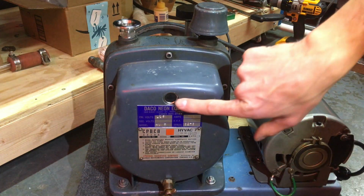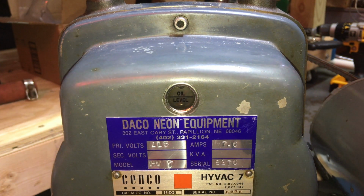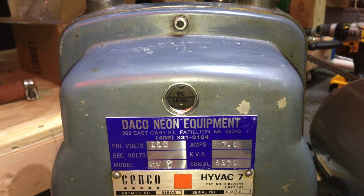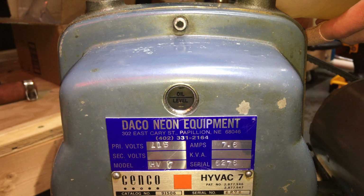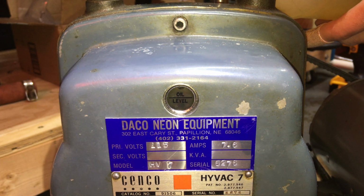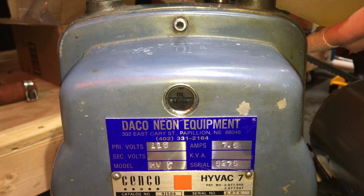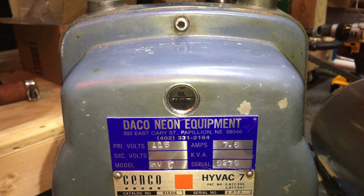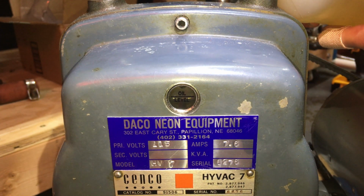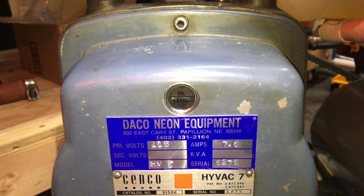And I guess there's no oil in the sight glass, so what we need to do is fill that up. All right, so we'll fill up the oil in through the exhaust port, and you guys keep an eye on the level there. Tell me when it's in the sight glass. We're low on oil because this system wasn't shut down properly, and it sucked a bunch of pump oil into the manifold. Someone had just turned the pump off, and then there was the residual vacuum in the manifold, which sucked it all up. So that's the oil level.